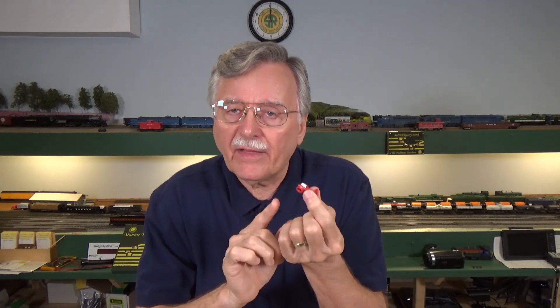That's why you might hear people say those suitcase connectors don't work — it's because they've been using the wrong size connector with the wrong size wire.